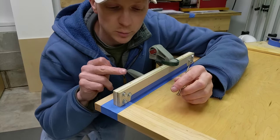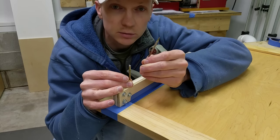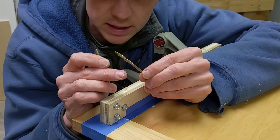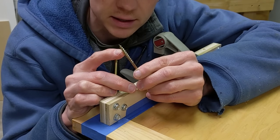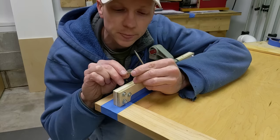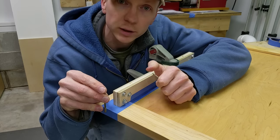To make sure I don't poke out the front of the cabinet door with these screws, I cut them to the right length. Here's the screw I started with and here's the one I cut, so this one won't poke through the front. The other benefit is that I got rid of the first few threads that don't really engage much wood anyway. Since I'm only going in through three quarters of an inch of wood, it's nice to have full threads into that three-quarter inch thickness, and that should hold pretty good.